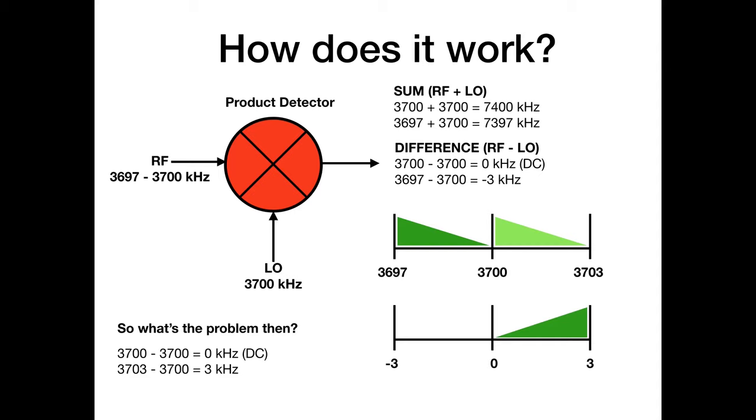And what happens is that, because it's occupying the upper sideband slot, that's why people say it receives on both sidebands, that will mix down just as it is on top of the signal that you're listening to. So what you'll in fact hear when you tune with your direct conversion receiver is the signal that you want to listen to. You'll also hear an inverted form of whatever is lying 3 kilohertz above it, right? Which is probably a lower sideband signal. So it sounds like upper sideband over the top of what you're listening to, right?